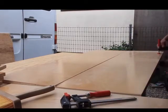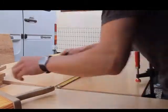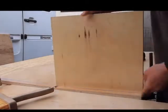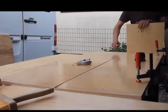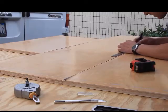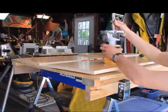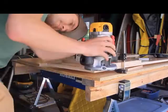Once I had finished cutting everything down to size, I laid out the two pieces of plywood that would serve as the base and the top of the media console, and then I marked out the sections where I would be making a dado cut. There are many different ways to make dado cuts, but today I'll be using my router to make these dado cuts, using a piece of plywood as a fence. I measure everything out and then clamp the plywood down to the work piece to cut out the dado.